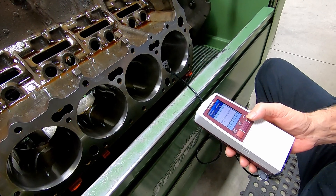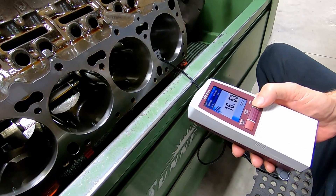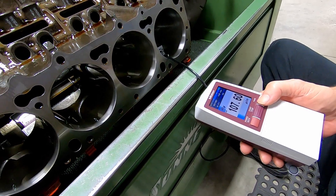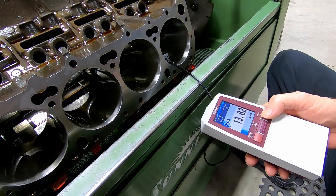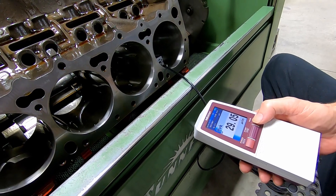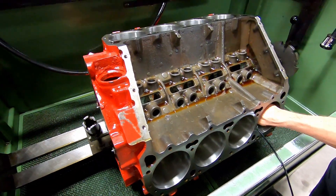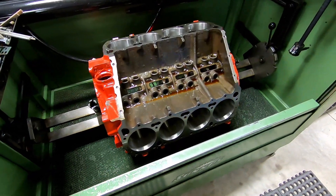The ones that matter are RK, RZ, RA, RVK, and RPK. RA is 12 — everybody's happy. RZ is 150, supposed to be 12 times RA, which is nearly perfect. RV — wow. RK — you can't do much better than that on your best day. RPK — that's not a number I spend a lot of time on. And RVK — you would like more, but it's a difficult number to achieve. So I'd say we did real good. I'm happy. It's a really nice block now. I wish we would have had more RVK, but I think you always end up wanting more than you do.